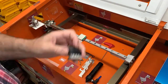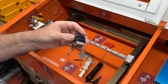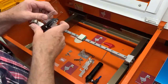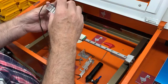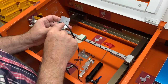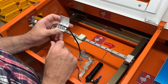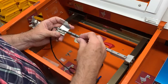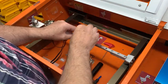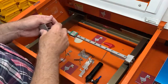And we can take the drive belt adapter with the belt pre-installed. As you can see, it does have to stand off quite a way, and what I've done on this is there is a nut missing off there and a washer. Extended the belt across just to give a little bit of extra strength in there, because when you punch a hole in this 5mm belt, there isn't a great deal of belt left. Also, we can remove the tape that was holding the linear block.